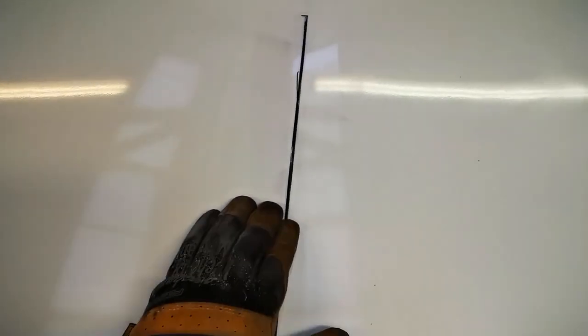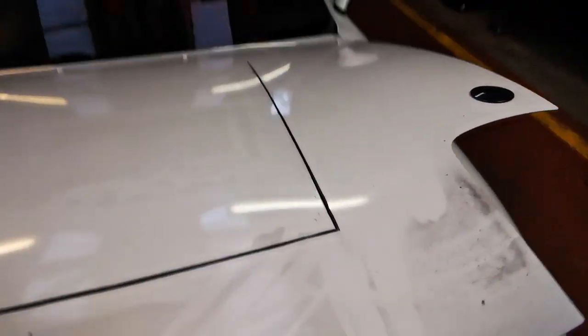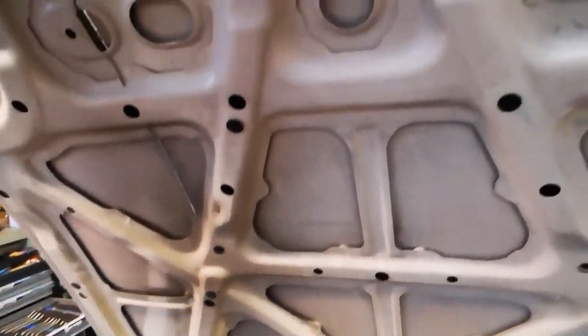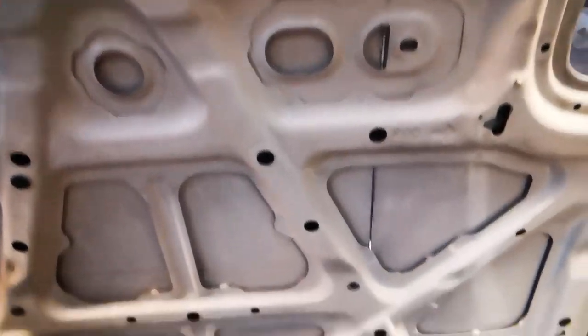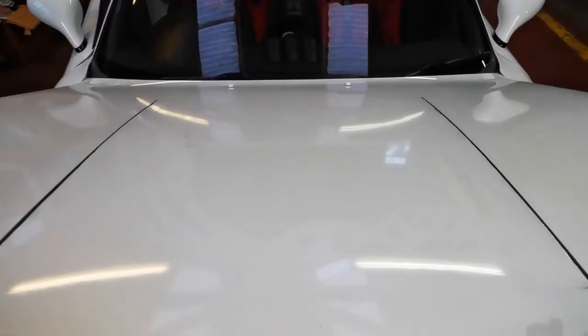So that's the top cut — it went pretty straight for the grinder. Now we're going to pull the bonnet off and the bits underneath. Obviously it's got all the webbing in the standard bonnet, so we'll pull the bonnet off, chop some of that out, and then we'll be able to push the top bit down to meet the intercooler and see where we're at.